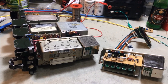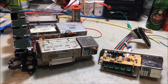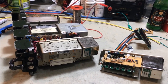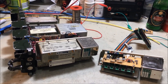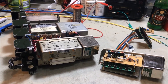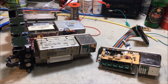not only the Arduino projects, but the Arduino modules that you can buy, VFO modules like I used in my prototype, the wave shape, especially coming out of the fixed frequency oscillator, was atrociously square, with all sorts of spurious harmonics hanging off it everywhere. And it took extensive filtering to get it down to anything like sinusoidal to use on the fixed frequency. The radio just would not accept anything that was too far away from sinusoidal. So that was a real pain in the neck in itself. So with this particular conversion, I've picked a DDS that's only got one output. Could be a downside. We'll have to just wait and see with that one.